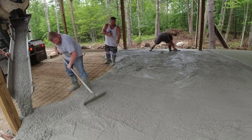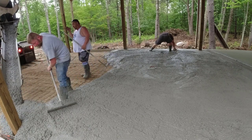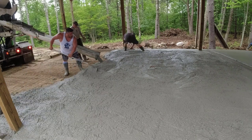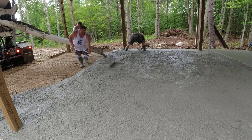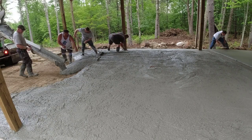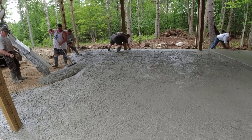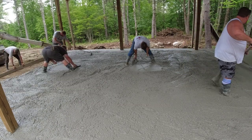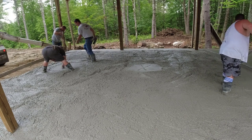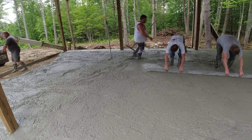You can see around that 6x6 post right there — Sean's got some rebar tied in around that to make sure that all holds together really, really well, because there's probably only about 6 or 8 inches of concrete on the outside of those. Luke's in the background — he's kind of magging the edges even with the top of the form. We'll get most of this poured out, and you can see we stopped right there. Now Luke's magging the pads and then he's pulling the stake out. Then we put an X in the pad when it's right to grade.